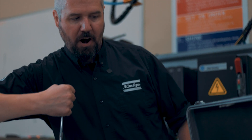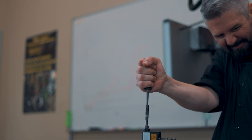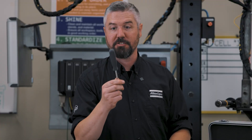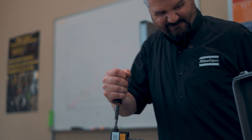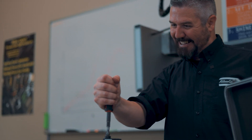We'll do these tests one-handed and see how high we get. There's almost five Newton meters of torque with a small, cheap screwdriver. Let's try a beefier screwdriver and see if we can get more force. There's double the torque with a much bigger handle. The failure mode now is my hand slipping — I can't twist this thing any farther.